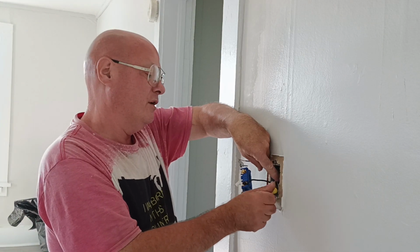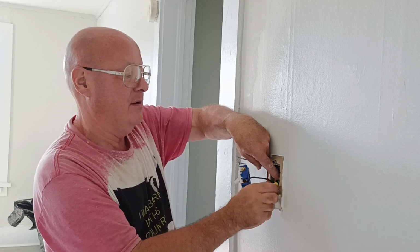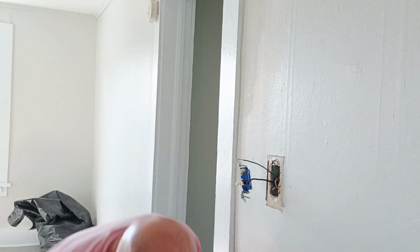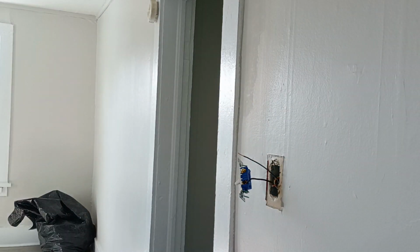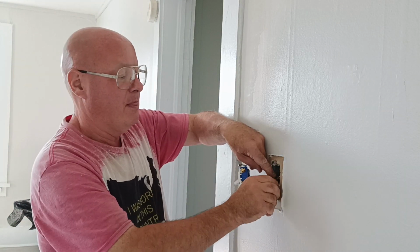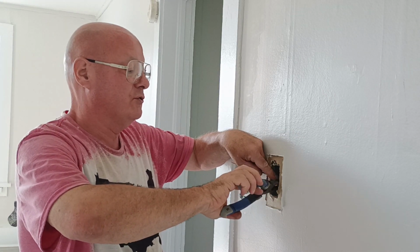Okay, I'm going to put my wire nut on. I'm going to make sure my insulation is going up into the bottom of the yellow wire nut there. And thank you, Lord, that's not tightening. You know what? I'm going to praise Him and worship Him. And I'm not going to frustrate. I'm going to clip it slightly more here so that maybe it will go. It doesn't. I just praise Him. Just give God the glory. But thankfully, Heavenly Father, it's tightening. Let's give it a nice twist here, make sure it's good and tight.